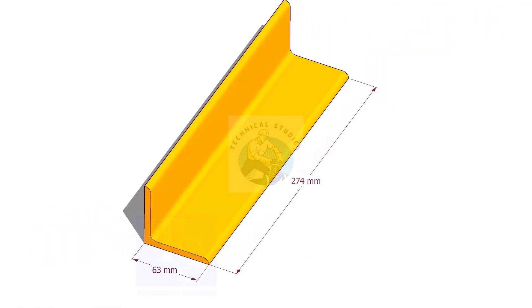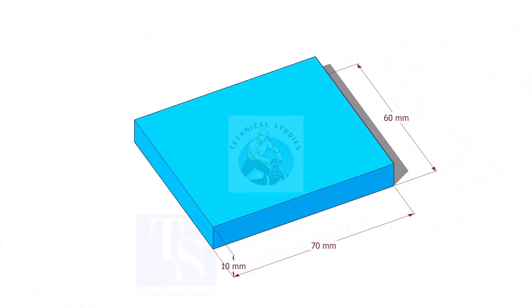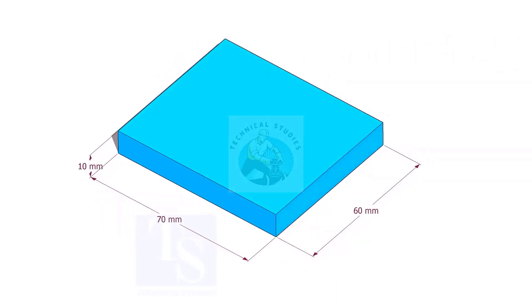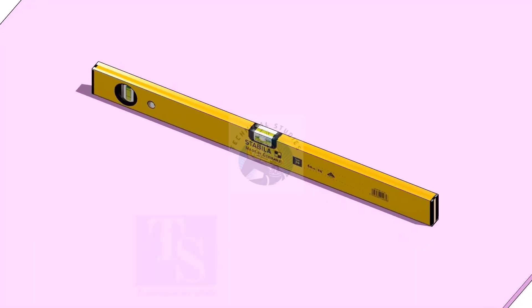Up to 4 inch of pipe size, you can use 40mm to 75mm angle bars; the length shall be 300mm to 500mm. The thickness of the base plate shall be a minimum of 10mm. Choose a level plate and fit up the angle and the plate as shown.